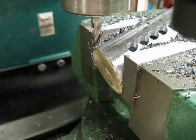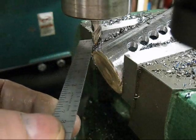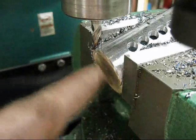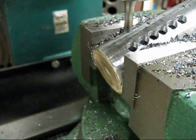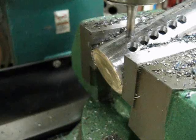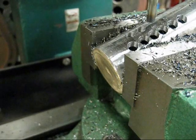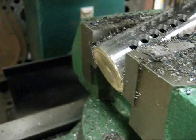Just get her done. Simple math told me it was three quarters of an inch from the side of this cutter to the jaw vise, and also three quarters of an inch from that side to that side — and that gave me a center on the drill, on the end mill. You want to do the best work you can, but get her done.